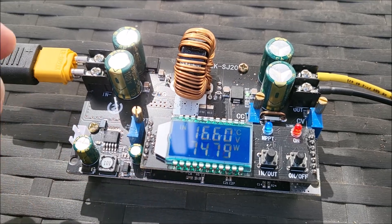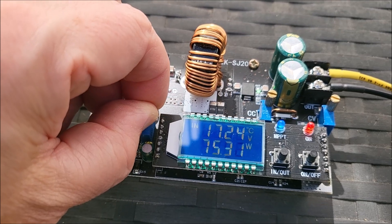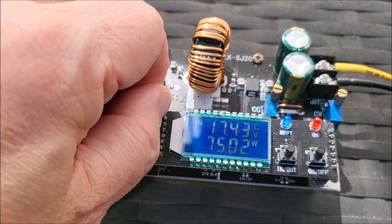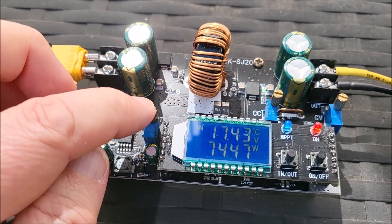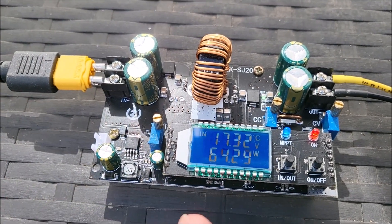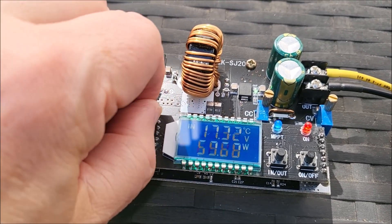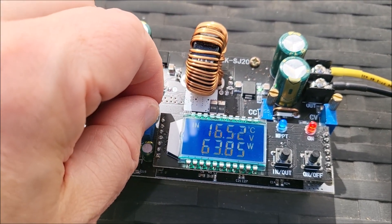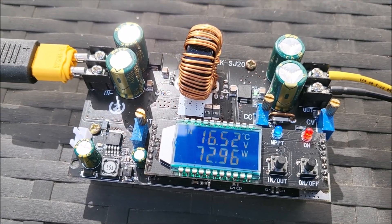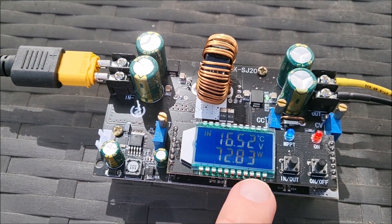Now the sun's coming out I might get a bit more power, raising the voltage possibly a little more because the panel has cooled down a bit. This is why MPPT charge controllers actually hunt for the maximum power point — they're constantly moving either side of the current power point to find where that maximum is. So the panel will be hot again now and we'll probably max the wattage at a slightly lower voltage.